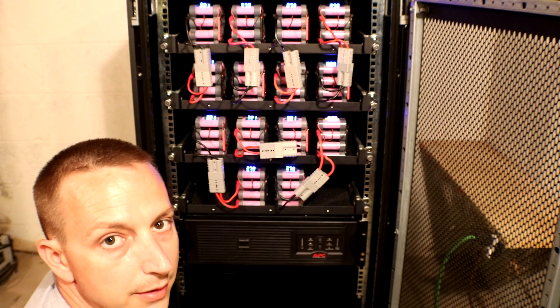Charge controller hooked up — check! That's how you hook up a charge controller. The manual says don't mount it to anything burnable, so instead of a piece of wood I just mounted it to the concrete wall. I'm not sure how permanent this spot will be, but this is my testing area. Once I figure out the permanent position I'll make an update video. I still need to get some circuit breakers, disconnects, and more two gauge wire to go from the charge controller to the batteries.